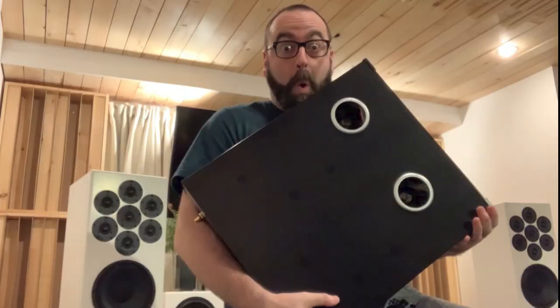The MPP2 that I posted - the monster, the big one. So I enjoyed it stock, then I changed a few things. First thing I changed was the tubes. Using 12AX7s or 6922-type tubes in that phono stage meant that with certain cartridges, the gain is just incredibly high. So even on the lowest gain setting via the dip switches in the back, those tubes have one of the highest gain factors in that family of tube sizes. Even by lowering the dip switches as much as possible, on some recordings with some records it still felt too high - you'd get a little edginess on top and actually end up with a thinner sound because there was too much gain.